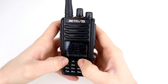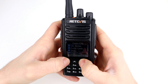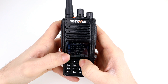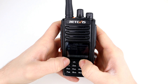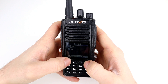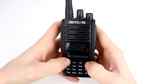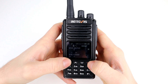Radio config lets you select receive frequency, transmit frequency, channel name, colour code, slot, shift frequency, shift direction, frequency step, and channel type — analogue or DMR — so it's fully programmable from the front. You can set key functions for the secondary PTT, middle button and top button. You can select zones — there are two programmed currently but you can add more. There's also GPS settings where you can switch GPS on/off, set time zone, view your GPS position, and time calibrate manually or via GPS.